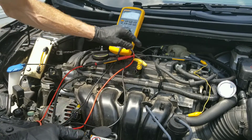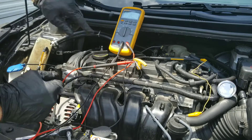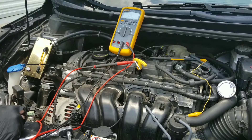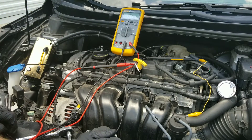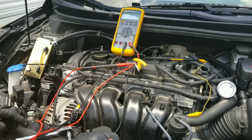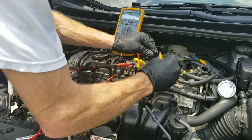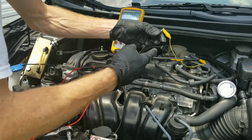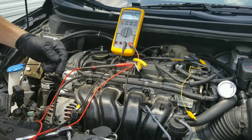What you want to do is take your positive and negative leads of your multimeter. I like to use these little alligator clamps to hook to the end of them. There's a setting for ohms or resistance — make sure you have your resistance set. It looks like a horseshoe, so just click on it where it looks like a horseshoe. Make sure it does not say kilohms or anything like that. Then connect these together and make sure that it zeroes out. If not, you're going to have to subtract that from your reading, especially using these little alligator clips.